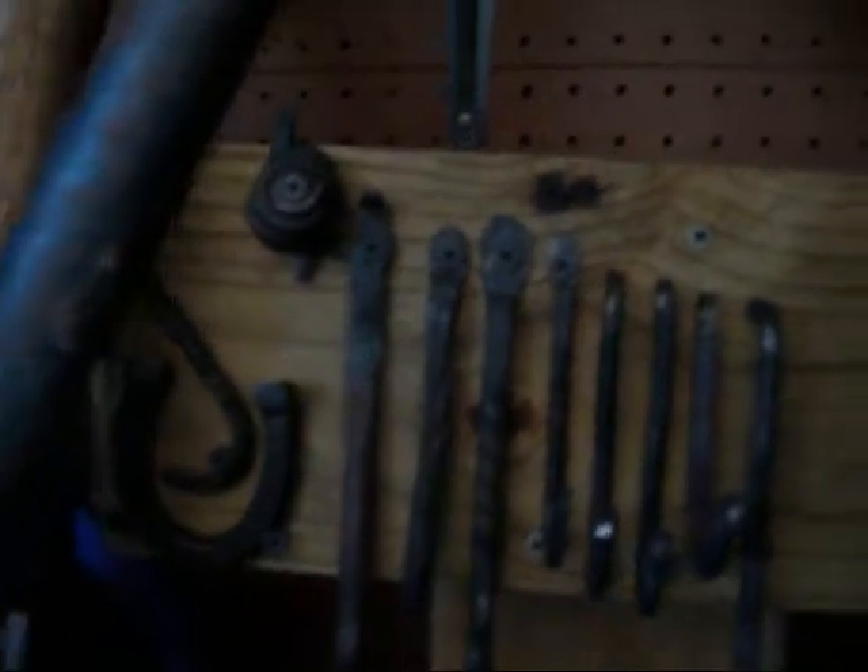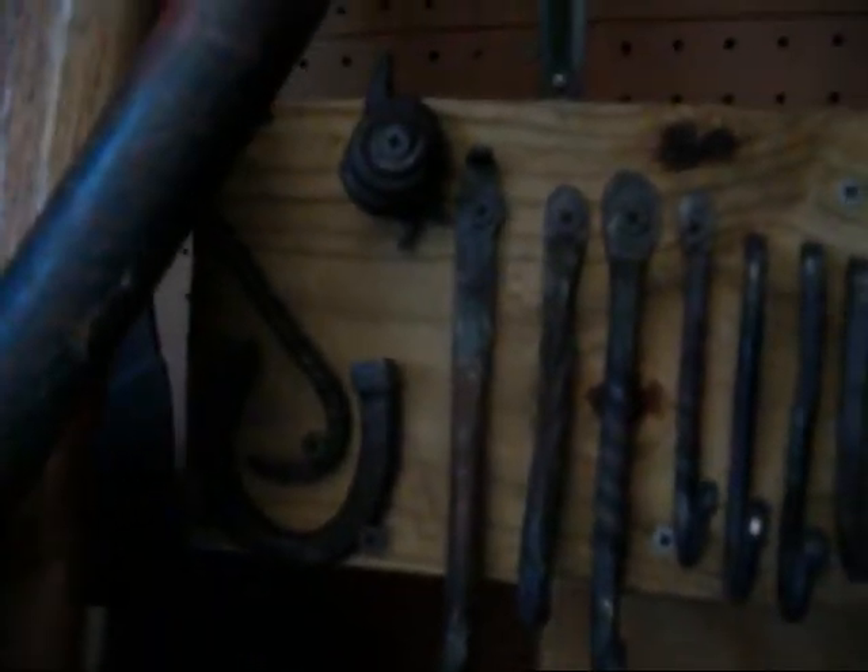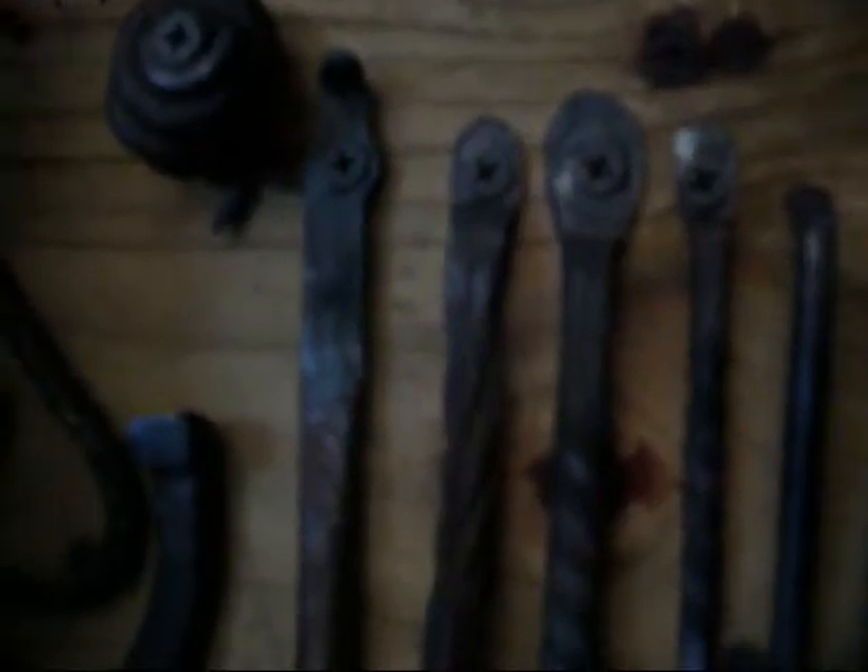Here I'm starting to build a little display stand. I've just got an arrangement of hooks. There's an S-hook there. There's a small horseshoe - I've been working on learning to make heel calks and stuff lately. There's a small steel snail made out of 1/4-inch. Those are a few 3/8ths hooks - one's plain, and one's flattened out so you don't have to drive it into the wall. Same with those three. That one's got a small pineapple twist. That one's got just a plain twist on square bar. And then these are all 1/4-inch - one flattened out with a hole punched through so you don't have to drive it into your wall, and the rest as normal drive hooks.